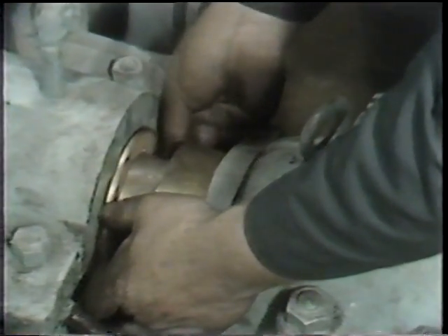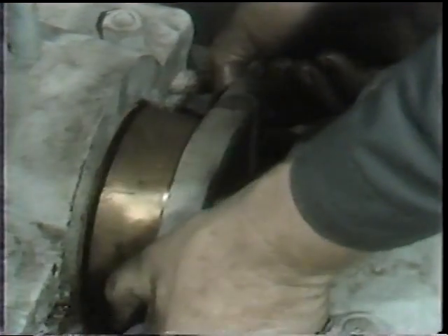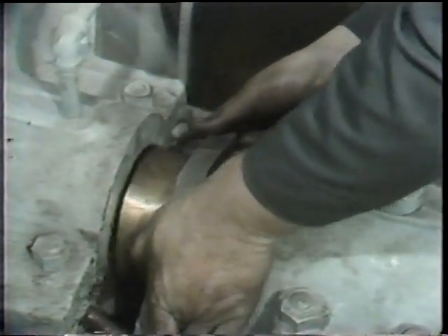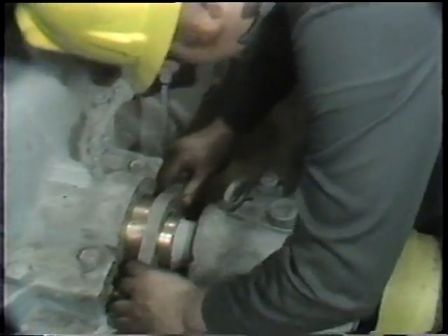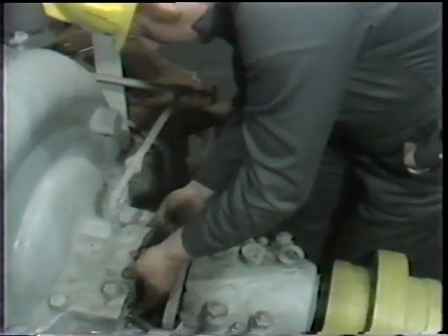In this particular case, water is injected as a sealing medium. Regardless of the reason for the lantern ring, it's extremely important that it be installed at the proper point — which in this pump is after the fourth ring of packing. The workman takes the two-piece lantern ring and inserts it into the stuffing box, using care to ensure that the two pieces line up properly, then fully inserts it against the fourth ring of packing.